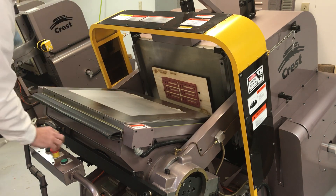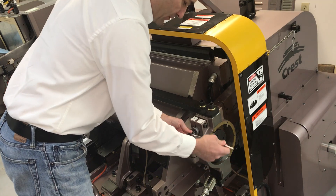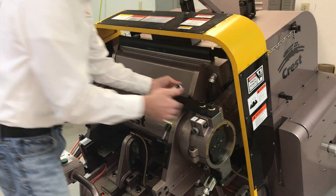I can now see just a very slight outline on the side of this substrate. Now I'm going to bring it up a little bit more, but I do not want to cut through. So this time I'm going to go to 1 to 2 — essentially that's half a turn. So I'm between 22 and 23, right in the middle of that.